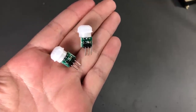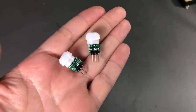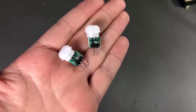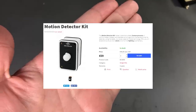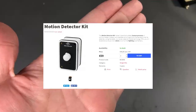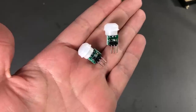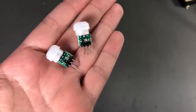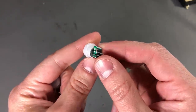Next I got a couple of small PIR motion sensors. The plan is to test these to see what kind of standby current they have and potentially use them in a battery-powered motion sensing node connected via MQTT to my gateway. I already have one such device from my Big Clown IoT kit — it's been running on a set of AA batteries for close to a year and a half — but they use a really nice low-power sensor which is not cheap. I would expect these cheap sensors from AliExpress to have higher current consumption, so let's put them to a quick test.